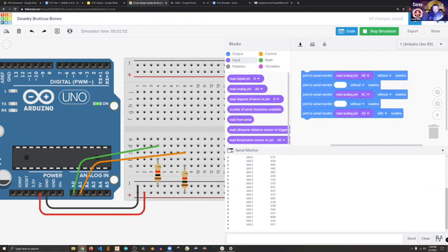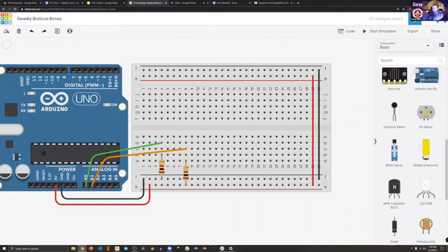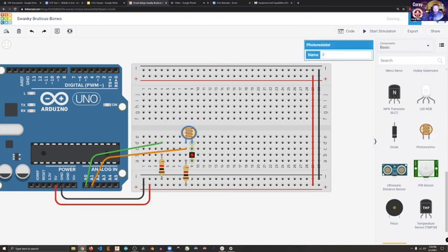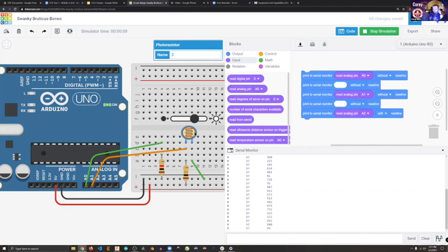So as the voltages jump around, you'll have all sorts of different things happen. What I can do is stop the simulation, pull the code back, and then hop in and do a photoresistor. If I put a photoresistor right here and then tie this into ground — this is basically one of those examples I just showed. Let's put this up to 10K. If I start this simulation again, I can click on this and watch that middle column. You can see it's different now — but if I change my amount of light via this slider — bright on one end, dark on the other — you can see the number changes. The Arduino is reading the voltage coming in between the light-dependent resistor and the one that stays the same. It's able to see that the voltage changes, but instead of telling me the voltage it uses an ADC to give me the rating.